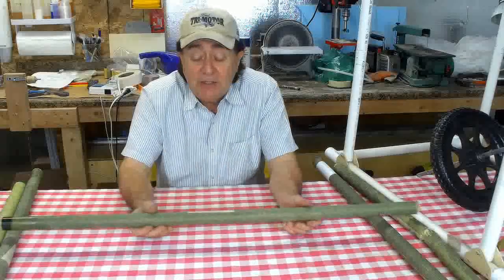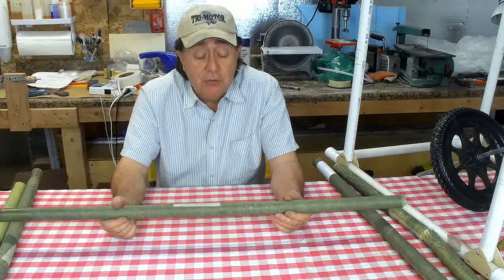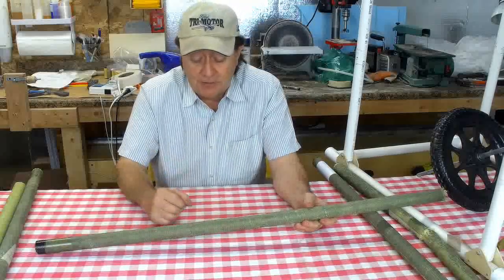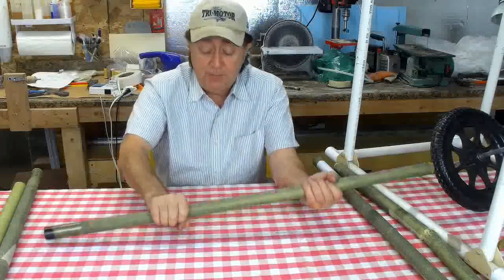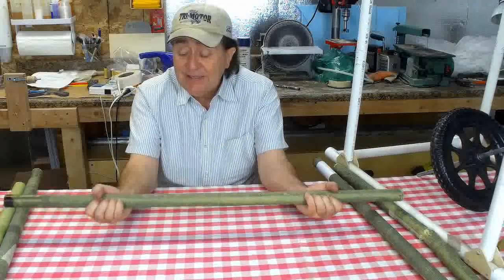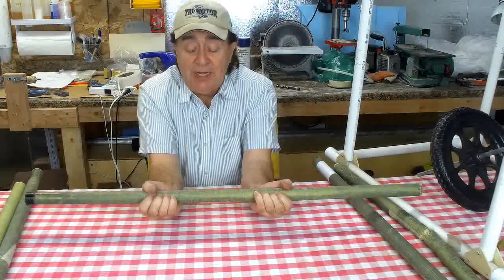In this particular case, we only have 1 layer of Kevlar. It's not enough to carry those hoop stress loads and prevent buckling. So I use bidirectional cloth, which of course has fibers running this way to carry those hoop stress loads. Still at 2 layers thick, this is a little soft. I can squeeze it with my hands, and it will actually flex a little.